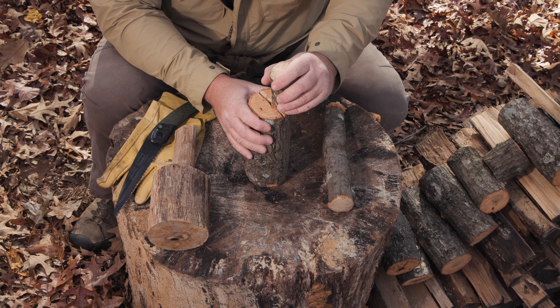Each piece of wood that I've sawed on one end or the other, you're going to start to see cracks that have formed in the wood, and we want to use that to our advantage. The first thing I'm going to do is start by finding the widest one — going to be about right there. I'm going to use my saw now to just go along that crack and create a score mark here on the top. Once I've cut in about a quarter of an inch, I'm going to go ahead and stop there.